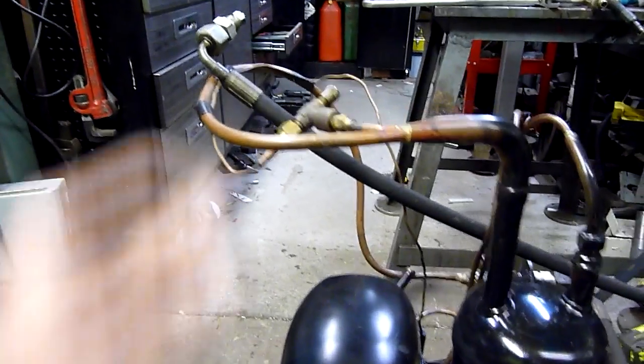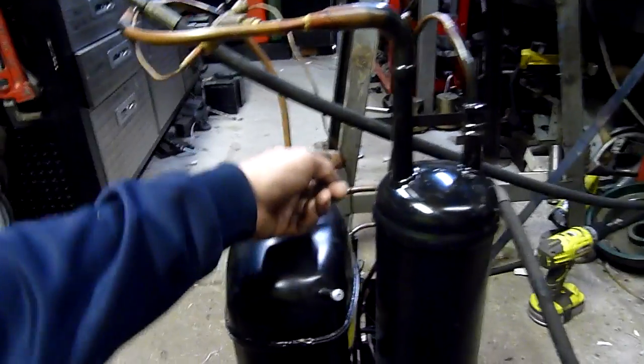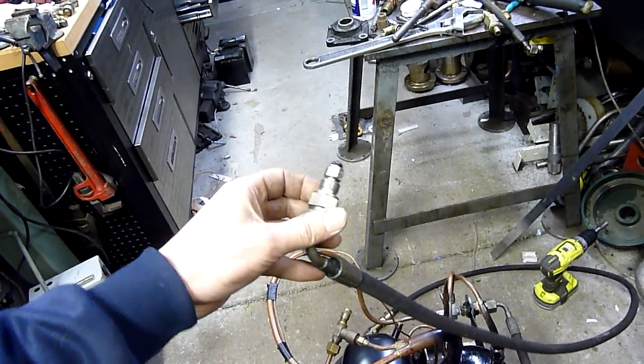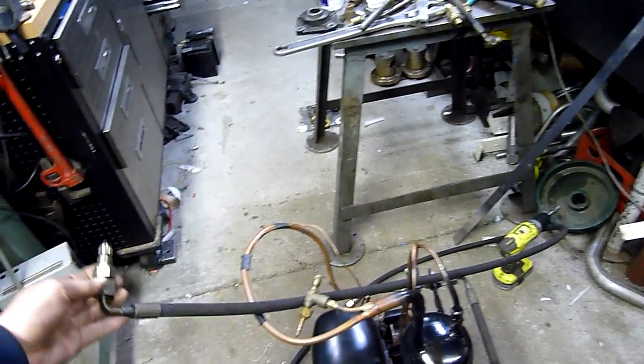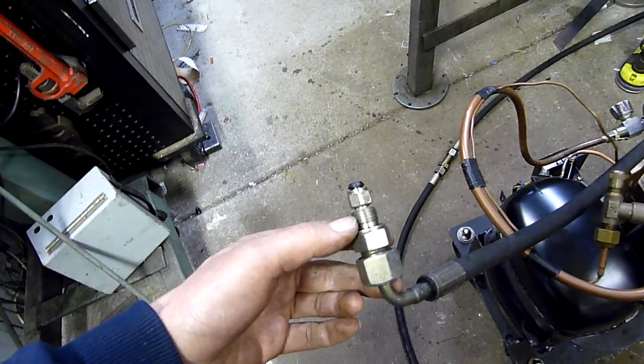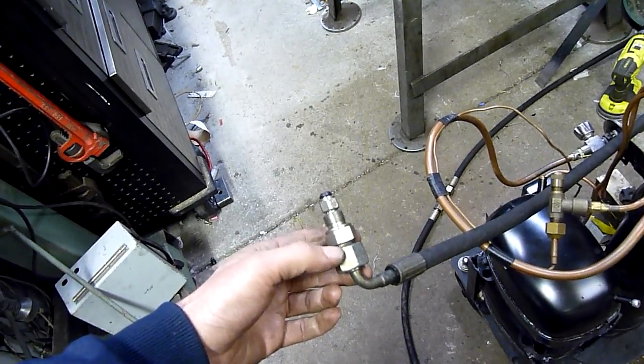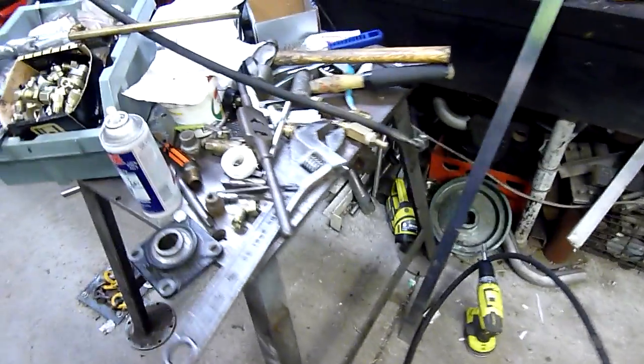Not really a lot else to it. I can attach my pressure gauge there, and I've also got that going to the cutout. It's fitted for the lines and fittings off the Battenfeld injection moulding machine. All of these you just tap a 3/8 BSP thread into whatever you want, and these flare fitting nipples just screw straight in — not a problem, they're really easy to work with.